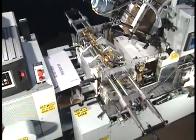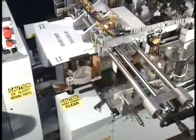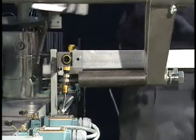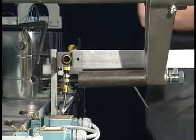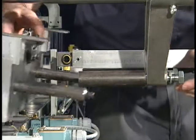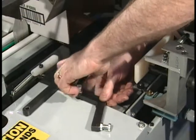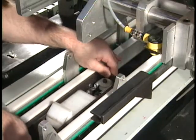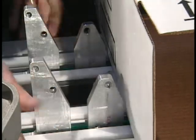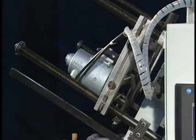The 31,000 packer can be easily changed from a two-pack to a four-pack configuration. The pusher assemblies are changed and the product stocks are repositioned. The spring pawl assembly and the index chain are then set to the carton size. The product size is selected and the hopper adjusted.